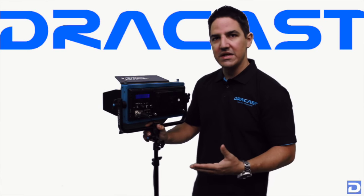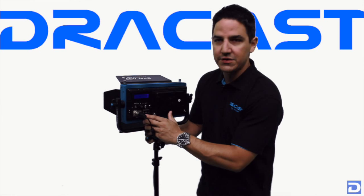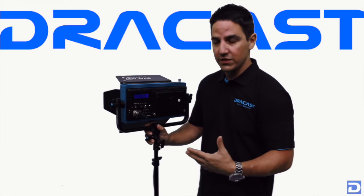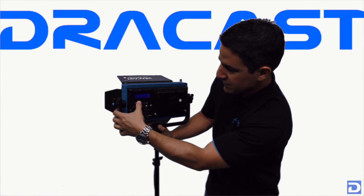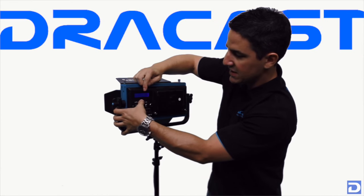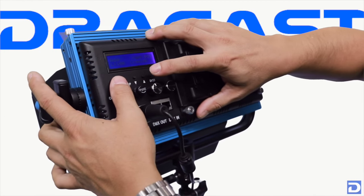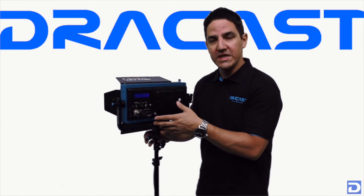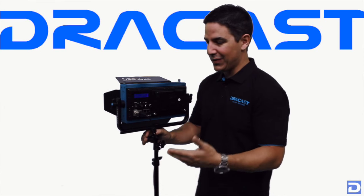We've changed from a 5-pin DMX connector to the RJ45 or CAT6 connector to make the connector smaller on the back of the light, but they still function the same way. You can run your DMX in and out directly to a control board and do your DMX assignments using these buttons. Press the setup button and the channel number — currently 001 — will start flashing. Use the up and down keys to set which channel or fader on your DMX control board this is assigned to. Set it to channel 5, press enter, and the light will be controlled by the DMX board on channel 5. These can also be daisy-chained so you can run DMX out to the next light and so on — a pretty cool feature we're proud to add this year.